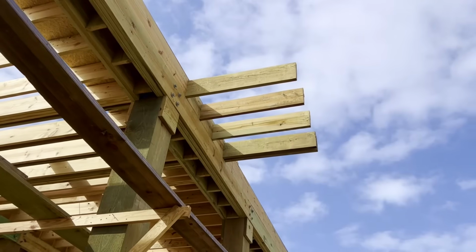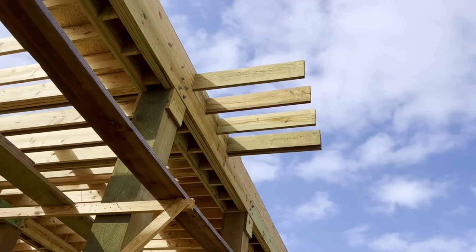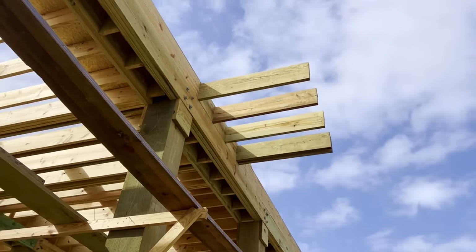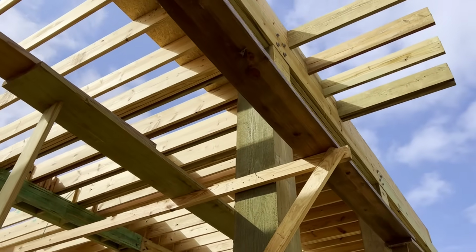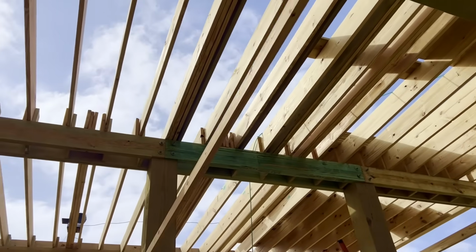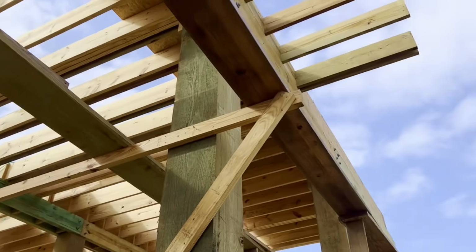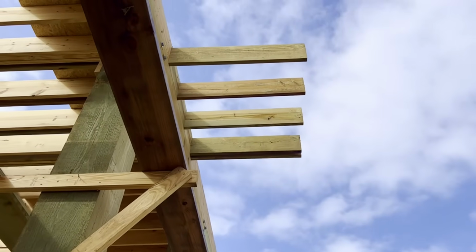It is day 9 in construction, the morning of day 4 of framing. All of our floor joists are in, all of our doubles, triples, quadruples, and beams are in. So now let's take a look. This is what will eventually be our AC platform. And the cool thing about these is you can see how our 2x12s are built into our floor system. They're installed in what is called a cantilever. You can see how they run all the way through and back, so the weight of the AC is offset by the house.